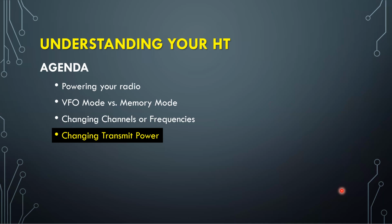We're talking simplex. Right. So, bigger antenna, having a repeater set up. There's a thing called crossband repeat where you can take a radio and transmit on one frequency and it retransmits it out on another frequency. So if you have a dual band radio, you're transmitting on the 400 megahertz band, and the crossband repeat will retransmit that on the 2 meter. So it's just like a repeater on the mountaintop. And you can set that at a location where people can have a line of sight on both sides of the mountain, and it will go ahead and repeat that. With ATVs, there's nothing stable.